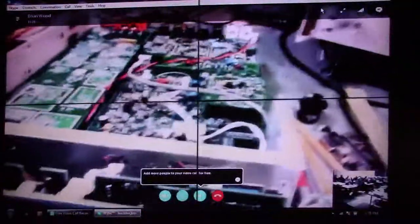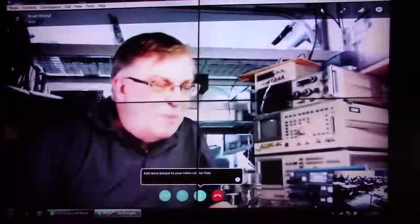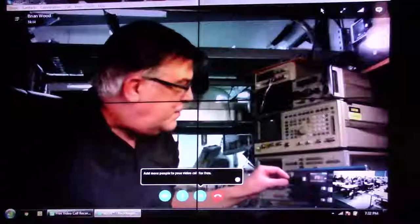It may not sound like it right now, but the audio quality of this thing is really quite good. The total harmonic distortion is about four times better than most amateur rigs, and we've used really high quality audio components throughout. You can actually run the speakers and the headphones separately — they've got their own separate amplifiers. I did this because when I'm doing Field Day and I'm in a room bringing people in all the time and doing demos, I wanted to be able to wear headphones and work people as fast as possible while somebody else is in the room giving demos. It's really distracting, so I wanted to be able to plug a headset in without turning off the speakers.